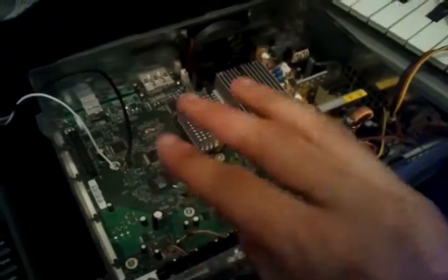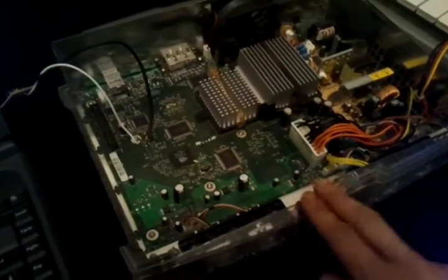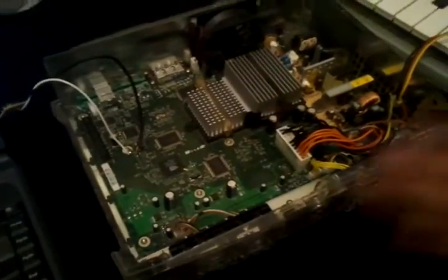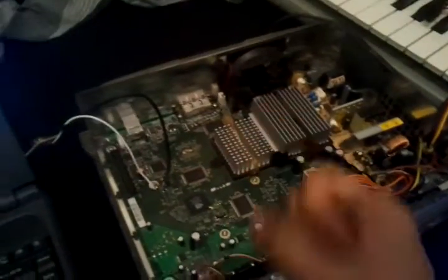I've experienced problems with doing this — sometimes the hard drives can detect when you've changed it, such as if you turn on the PC it will first reset the drive, so that's not handy, so you have to get it all organized. Secondly, SATA adapters just don't seem to work. The second, more reliable method is to read the actual EEPROM and then unlock the drive.